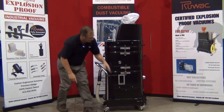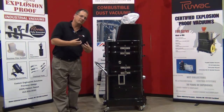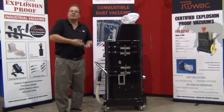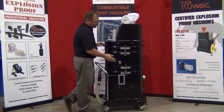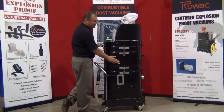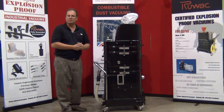There's also a sight glass on the front that shows the liquid level, indicates when the water is reaching saturation, and lets you see the turbulence inside. You'll be able to see if there's any foaming or dust getting past the water bath, indicating saturation point has been reached. In case of any off-gassing of hydrogen from the material, there is a hydrogen relief vent that automatically stays open at all times, venting any gas buildup.